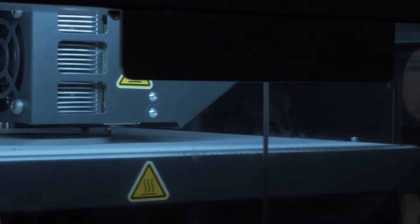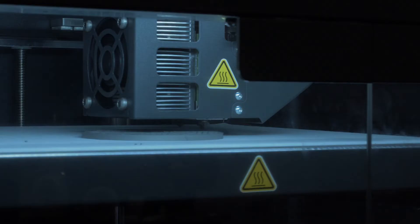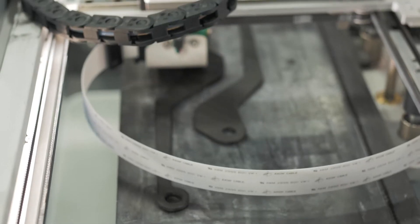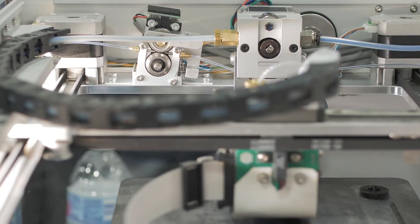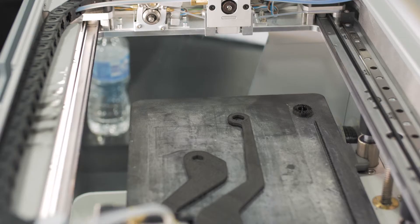There happens to be a very common material like this for metal injection molding, which is an industry that's been around for about 30 years. The idea was to take the material used in metal injection molding and instead of injection molding it, print it into the shape of your part one layer at a time — the same thing you do when you extrude plastic.